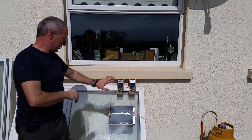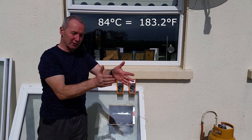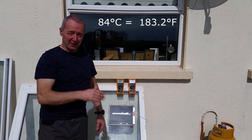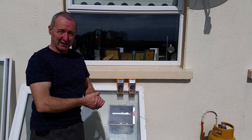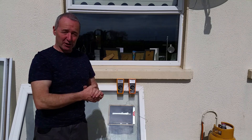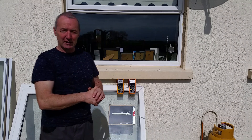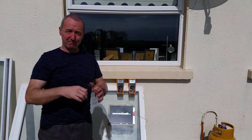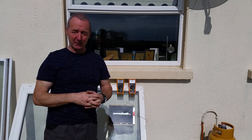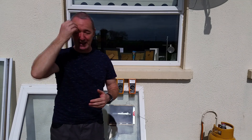So what I'm going to do now is put some insulation behind this window, stand the window, put a spacer to separate the insulation from the back of the window so I can fit some pipe on it — maybe some black metal plate, fix the pipe to the plate so that its surface area is enlarged, and then pass water through it. Seal it all up around the sides with foam and timber, weatherproof it, and put it on the shed's gable wall, because the roof faces east and west and is no use to me.